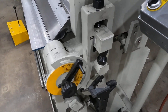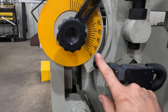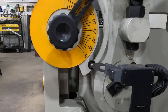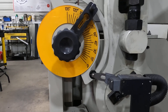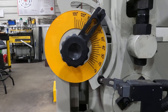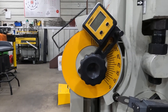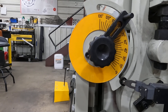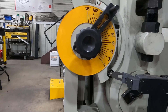There is a degree wheel here, and this is what will stop you on your limiter. Once you get your angle figured out you can set that and get some pretty consistent results. The actual degree numbers in my opinion don't really mean anything, but they're there if you're a number person. I actually end up using this more often to figure out if I've got a piece — 12-gauge 10-foot or something — that I need to repeat, or jump to an 8-foot back to a 10-foot, because you're going to have different spring back.